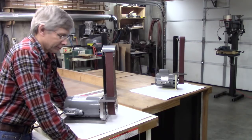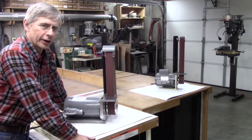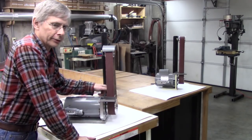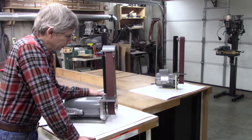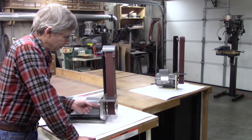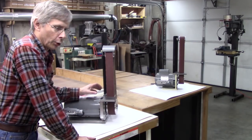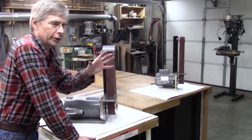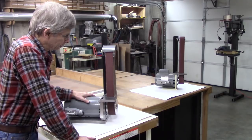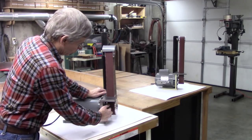It's really not a super difficult build. I made the first one before I got a mill. Cutting that hole for the motor mount is probably the most difficult thing. You probably could just cut a groove in the plate without boring all the way through it. You know, you could put it in your four-jaw chuck in your lathe and just cut a groove in there and then cut a hole in the middle. You don't have to go all the way through like I did.